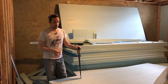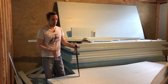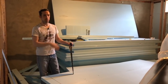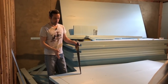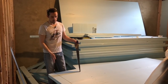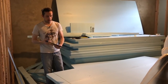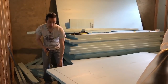To make things more efficient, I'm pre-cutting all of my XPS boards to the proper height. These are 8-foot boards but I'm only taking them to the top of the concrete wall, which is a little under 92 inches, so I need to cut off a few inches. I ended up making a clear line and then using a regular handheld wood saw turned the other way — I found that was a little easier and gives you more control.